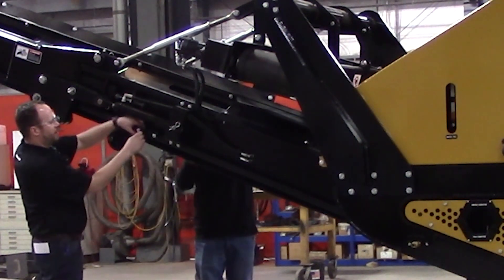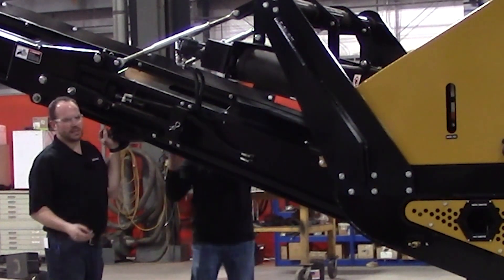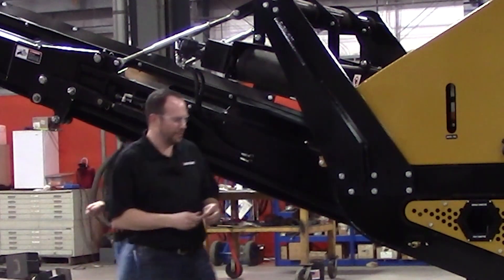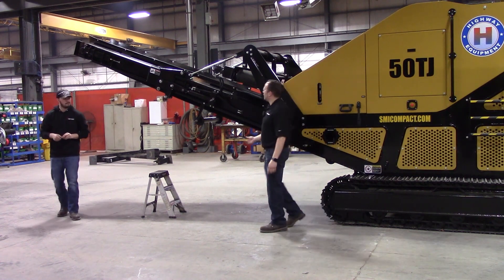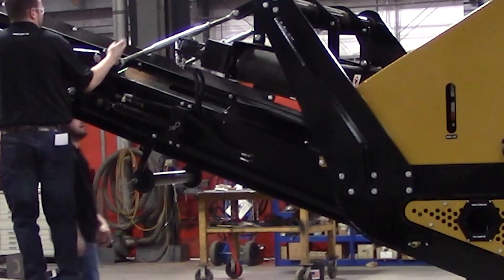He's going to get the bolt on the opposite side. You've got a bolt at the rear and a bolt on the front. The bolt on the front is the one that you're going to want to take off. Just push up on the idler a little bit. We've already loosened this up to make it a little easier — just drop that down and let it hang. Hold on to the bolts and keep them for future use when you go back and put that back up. The next thing we have to do: grab the one on this side and get Eric to grab the one on the other side. We've got to take these pins out.